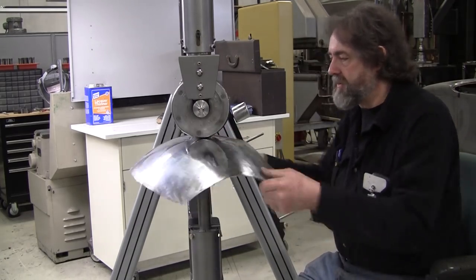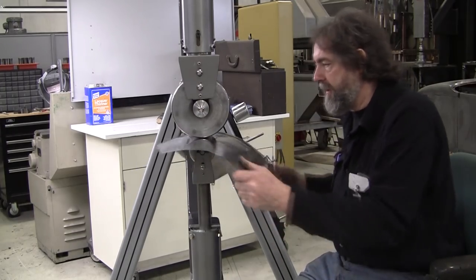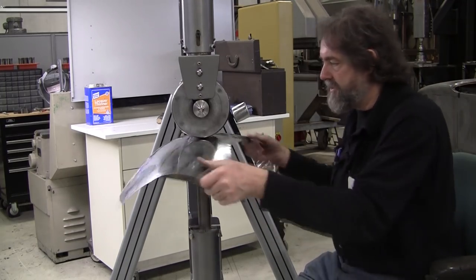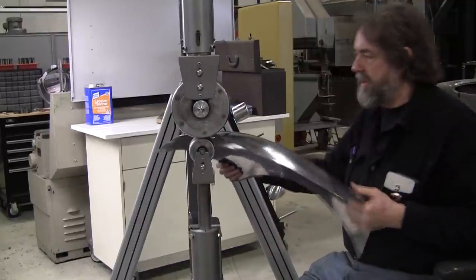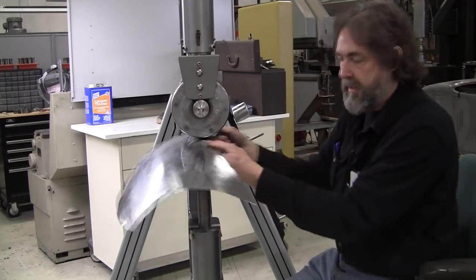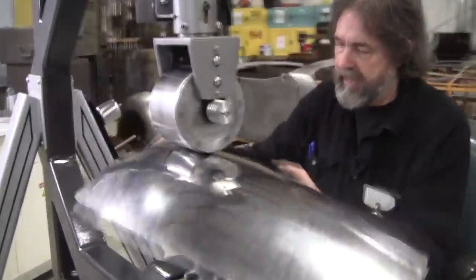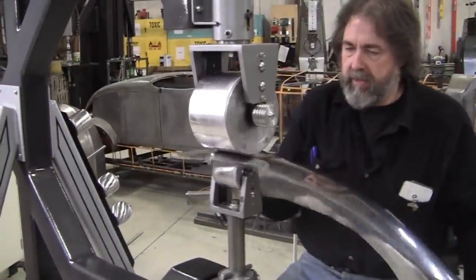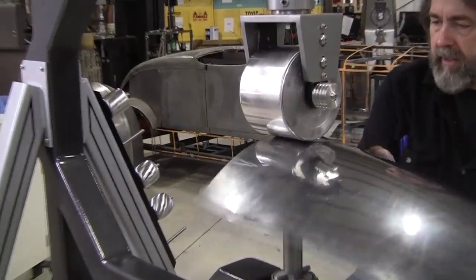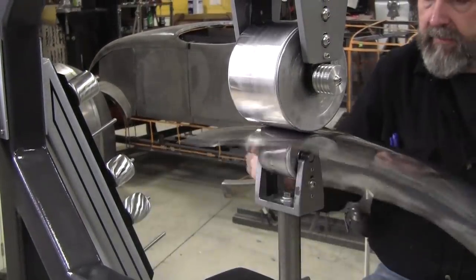And all these panels are going to have a certain amount of filler on them, not Bondo or lead or any gross filler like that, but they'll have primers. If you do the job right, all you need is a primer. And primers today are just amazing. All paint systems are amazing today. So you can hide a lot of sin with just paint today. They've got high build primers that will fill a lot of defects. And a lot of those paints today, which are very expensive, really stand up.